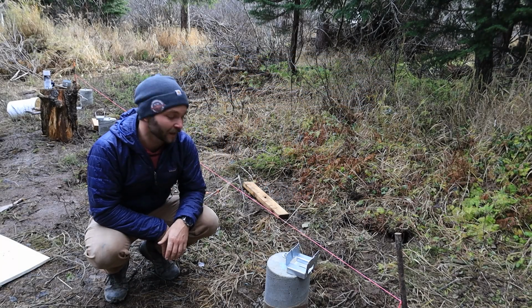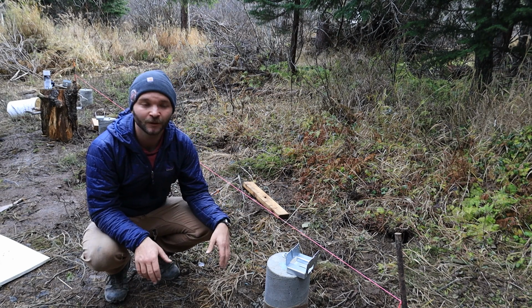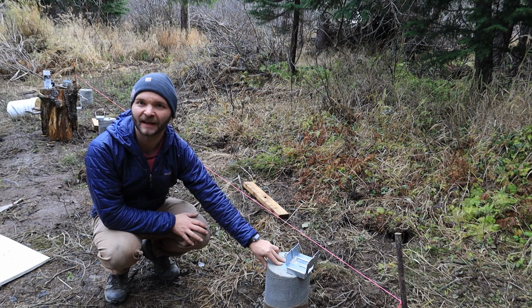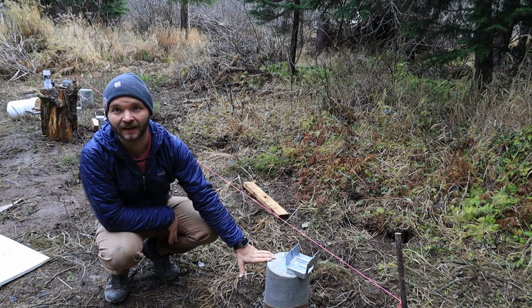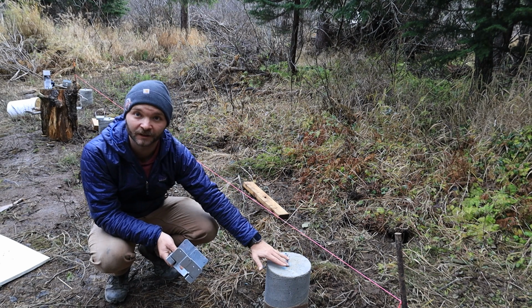All right, welcome back. I've been up here a time or two since I last had the camera with me. Really just drilled some holes into these piers and then put a bolt in. I think these are 3/4 inch, maybe 1/2 inch bolts. And then used just cement masonry adhesive to really lock those in. They stick about an inch out above the concrete.